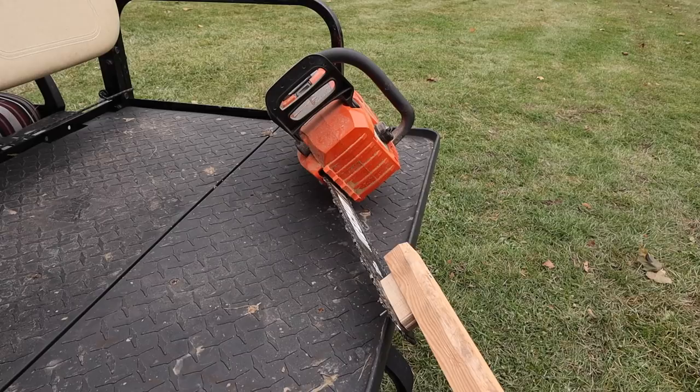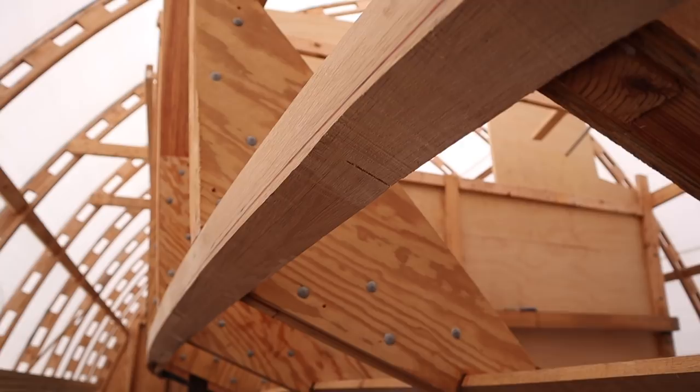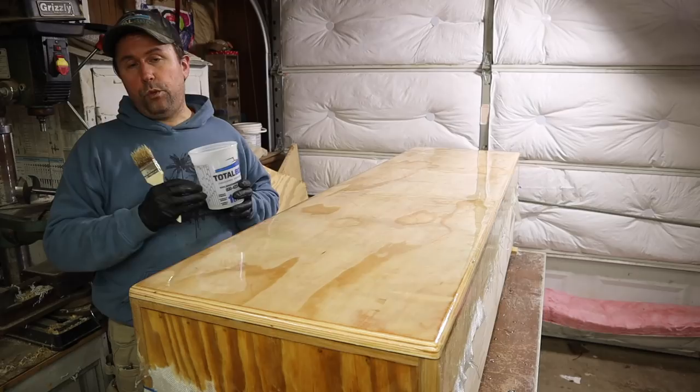And I think with two people working together, we can handle that rolling bevel as it goes around the boat. And it doesn't have to be perfect. We want to leave plenty of material to address the issues we have with the alignment of the bottom frames. So I think that will be the most effective way to efficiently do it safely. And in the next video, I hope to have some actual footage of that process.